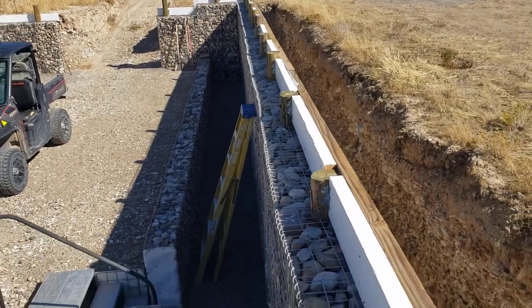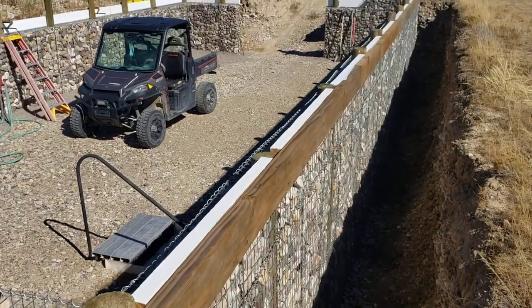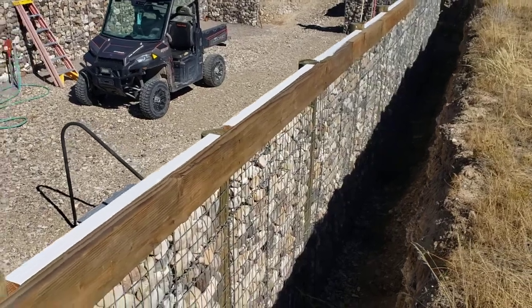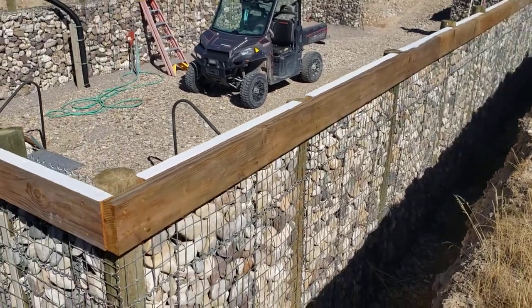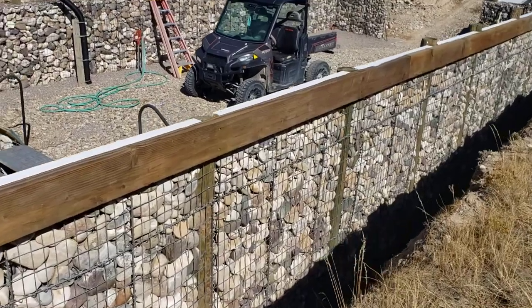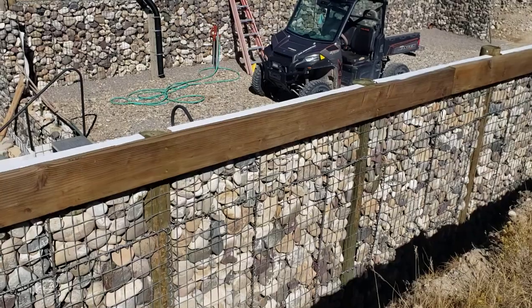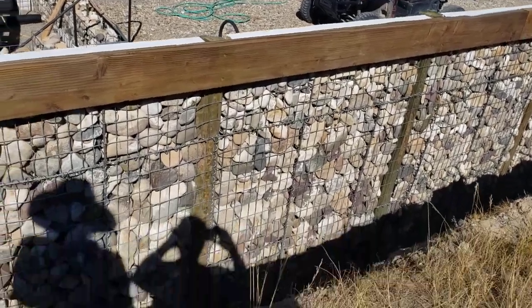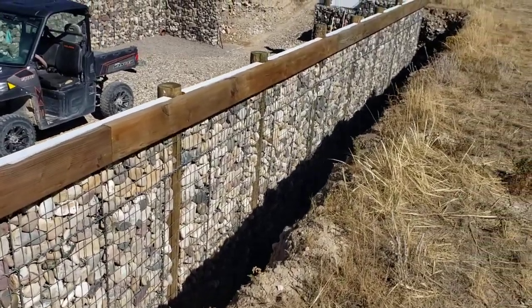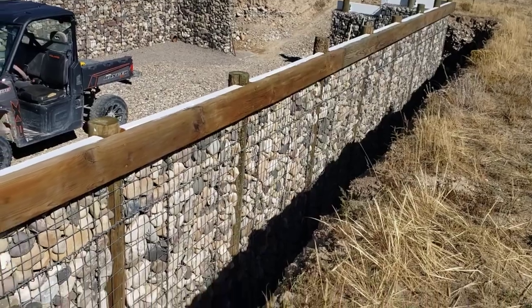So why we're doing these timbers — of course they'll support the front of the building, the trusses, the web trusses — but also this is where we're going to be putting a pond liner, a waterproof liner, and attaching it to the top and laying it down through the rock wall there, the cages. This whole building would be wrapped in it from the outside here.